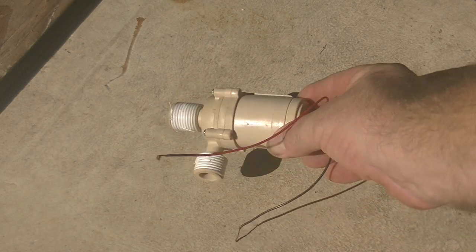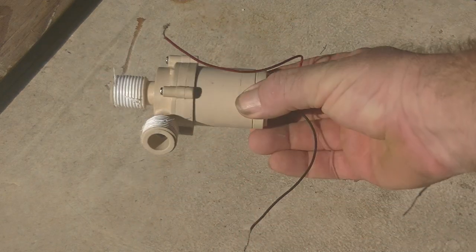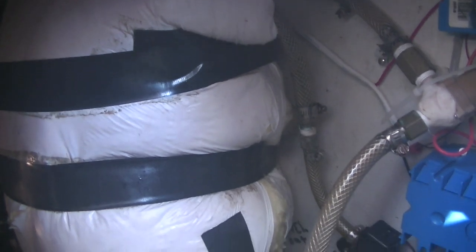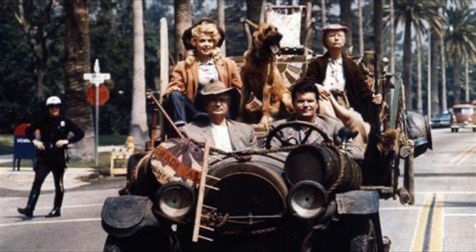This is the circulation pump and it runs directly off the 15-watt PV panel up top. It keeps the water circulating through the panels all day long. The tank itself is wrapped in a fiberglass water heater insulator blanket from Home Depot and is secured with duct tape. We know this might seem a little ghetto, but it worked and we're on a budget, so don't judge.